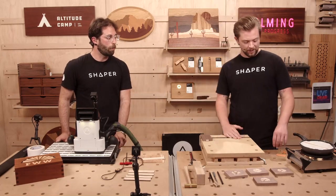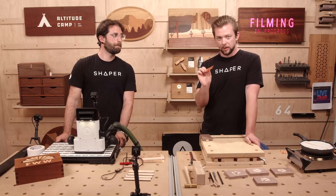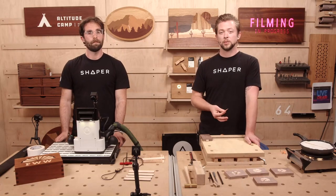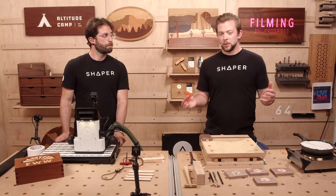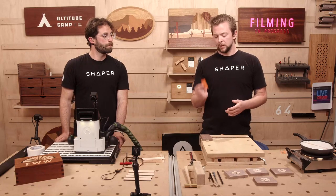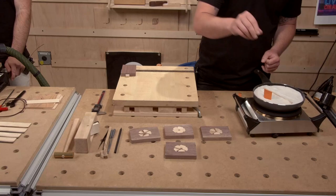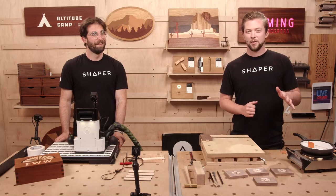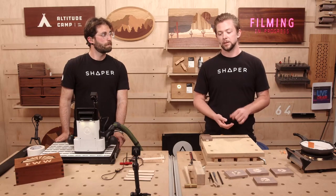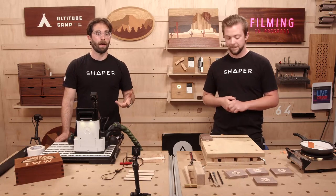I see you just picked up a piece of thin orange veneer — could you tell us a little about that? Traditionally, this method is done with super thin veneer like this. A go-to material is holly because of its brilliant whiteness, so the difference between the char is really stark. Here at Shaper, we like to do inlays with a little bit thicker material, typically around an eighth of an inch, so it takes a little more time but makes for a really stable inlay. With thin material, you just dip it in — around 15 to 30 seconds depending on how far you want that gradation to come up. It goes a lot faster and travels farther when the material is thin.